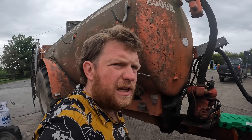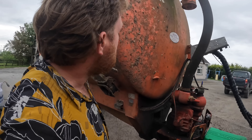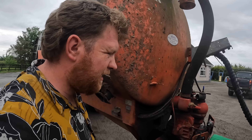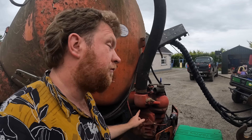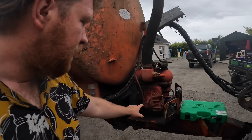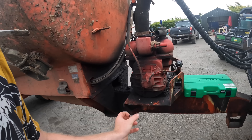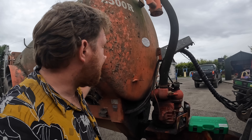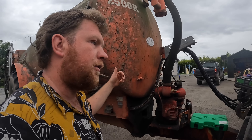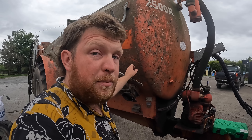It's a few days since we did the last tanker where the vanes were stuck. Now I'm going to do the other tanker - the hydraulic Abbey tanker we've had since 2013, ten years, and I don't think it's ever been opened. I want to do this for a while and now that I know what has to be done I'll whip that off, take off the circlip, the plate comes out and we can get into the vanes. There's no doubt there's a vane or two stuck because this tanker is quite slow to fill. I think the other one is 13,000 and this is 10,000 - something like that, there's a couple of thousand difference.